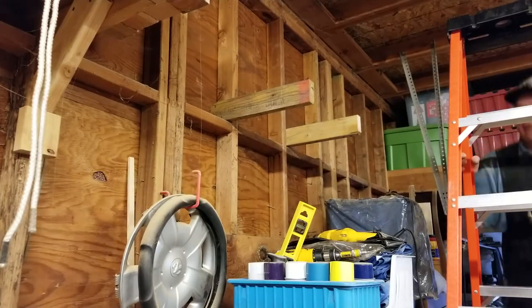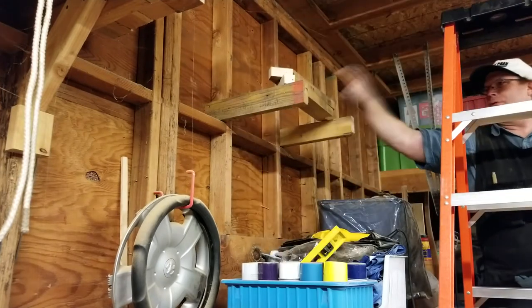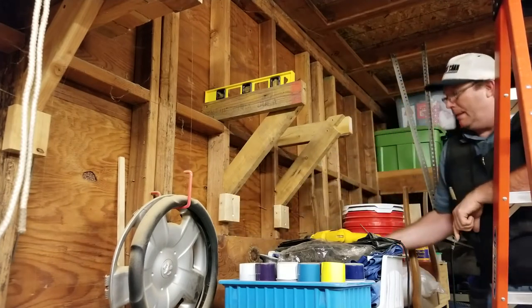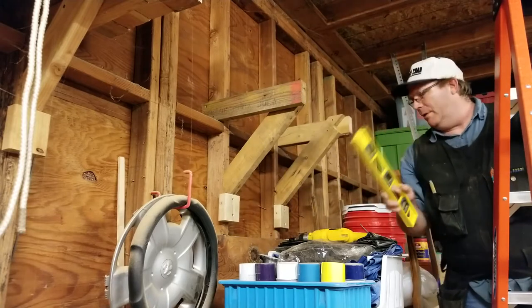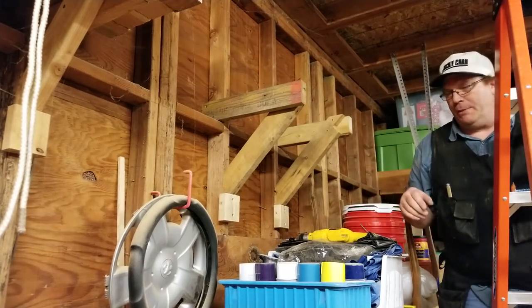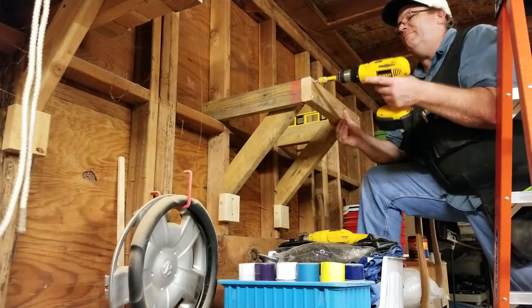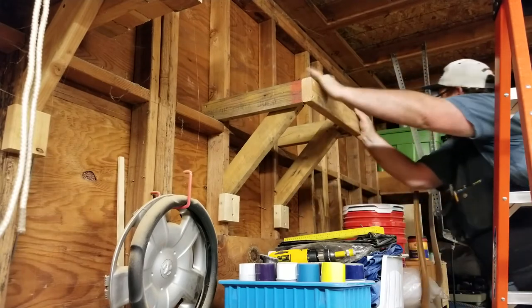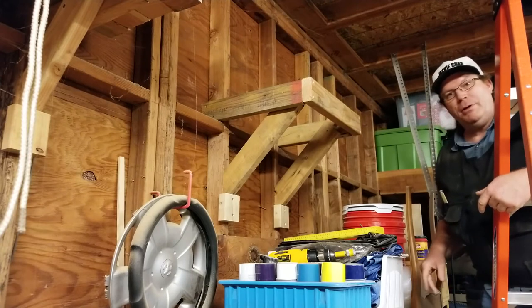Let me get this trimmed up and we'll come right back to this. Just got done making two of the sketchiest cuts ever. We're getting there, folks. It's a very good idea to countersink, at least on the little knee brace cleats here. Still level — that's nice. Now we just have to put a piece across the front. I always wait until last to do that because that measurement will vary depending on how much the boards are twisting and bowing out. Bracket one is done. I'm going to go ahead and get the second one done, then we'll meet back up and finish this video.